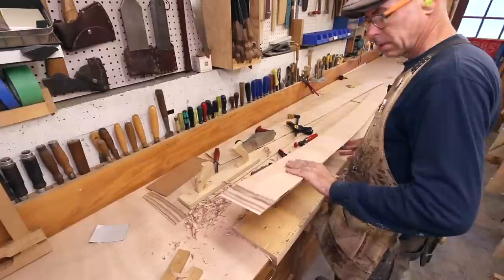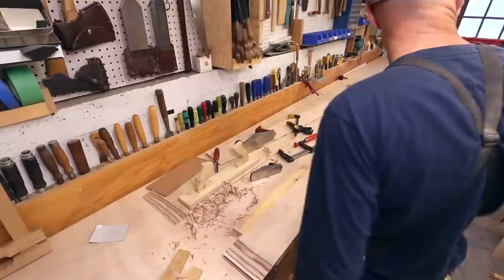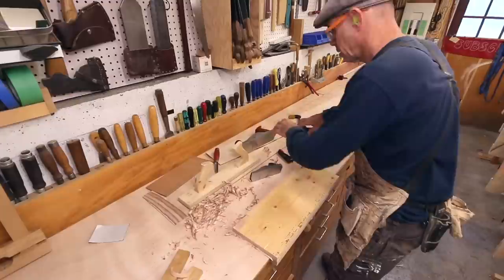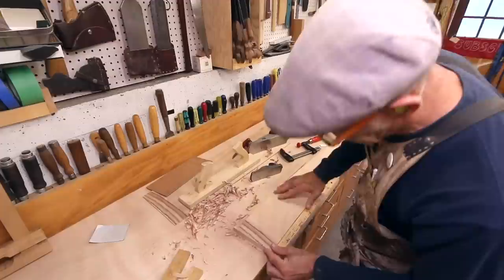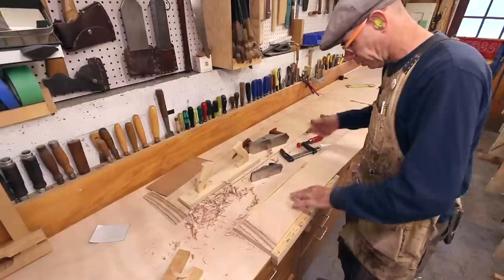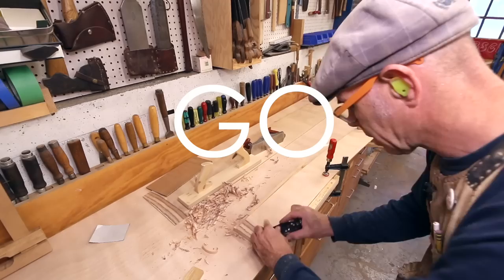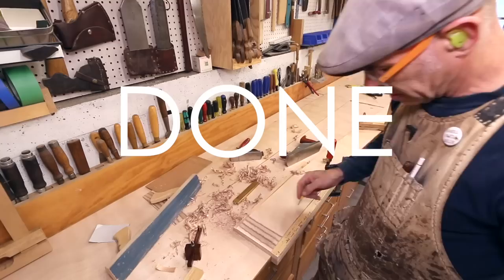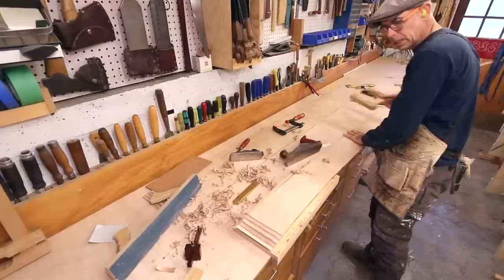All right, so this one is, get my port and starboards right. This is port, so I'm just going to throw a P right on there. And got the other side, same thing. See, this is what I was hoping for, that I could just butt this guy right up against the jig here and have it help support it. Maybe I should put a cleat on the other side so I can go both ways. That would probably make sense. There, so that's starboard. See how quick that is? Much less stress than trying to do a 4 foot wide scarf, I tell you that much.